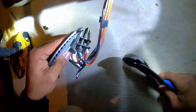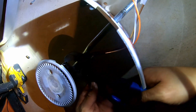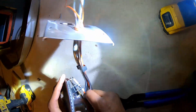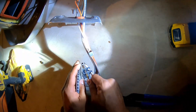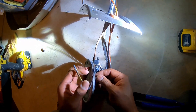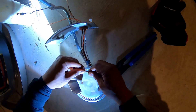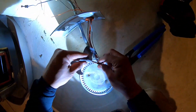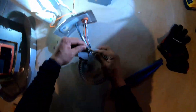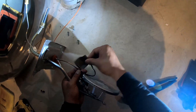I take my channel locks, wiggle it a little loose, then gently press it from the top and she should slide right out. This unit isn't that old. All you do at this point is get some sandpaper and scratch that surface off real good — nice and clean. Get all that corrosion and buildup off of there.